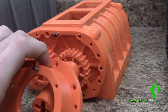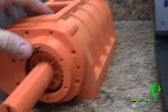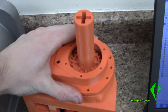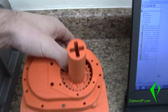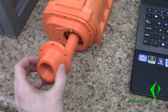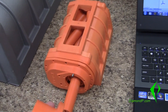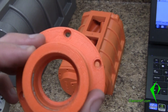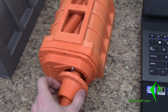I'll put the front plate or the front cover on here — it's a bit hard to do with one hand. I'll also take you down to the 3D printer in a second to show you how it was made. And put the snout on. I actually only reamed one hole in this snout, but all of these plates are dowel pinned. I didn't bother threading them for the bolts because most of the time when people come into the shop they want to tear it apart, so I just left it to the dowel pins.